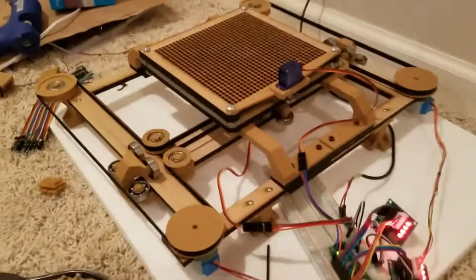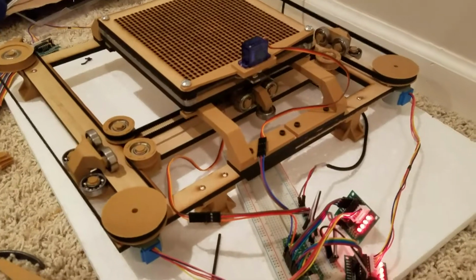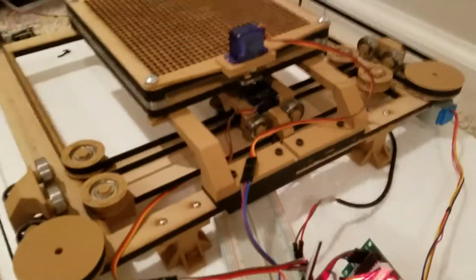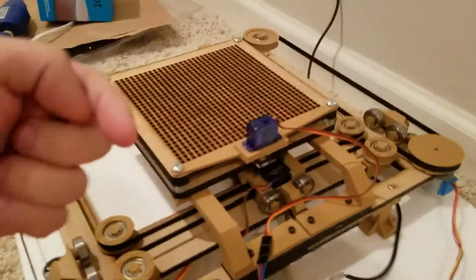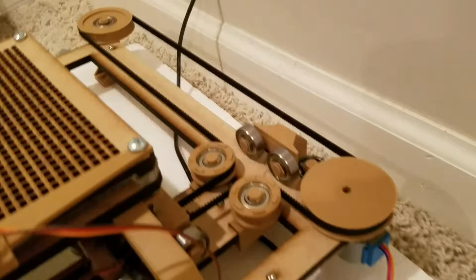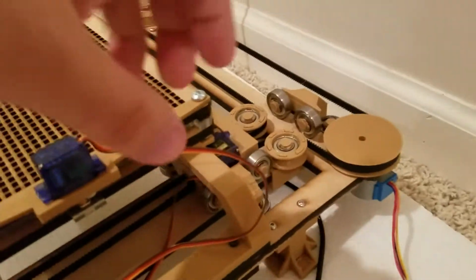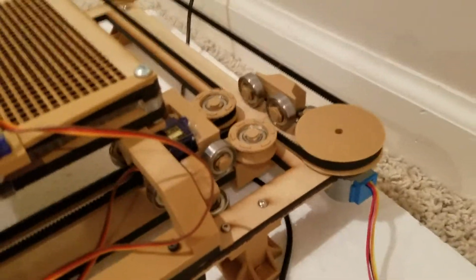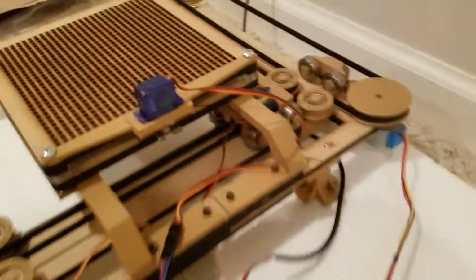And so all I have to do is tell it to start. And when I do, it'll first home the axes, which we're seeing now. And this goes particularly slow because I was able to do something really cool here. So rather than having it detect when it reaches 0, 0, it just runs the motor a little bit, turns it off, and then repeats that process. And so in doing so, it actually stretches the band ever so slightly, and then it retracts back. This means that you don't strain the motors, but you always end up at 0, 0 after you rotate it for the equivalent amount of moving it from this upper left corner.